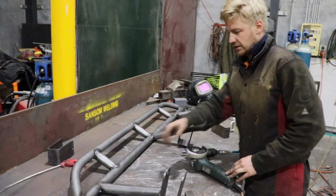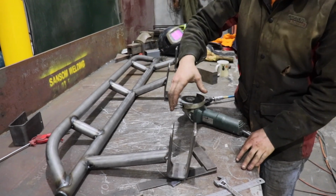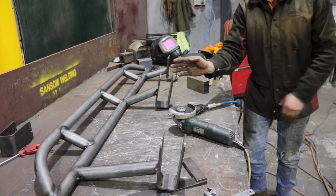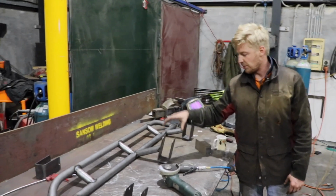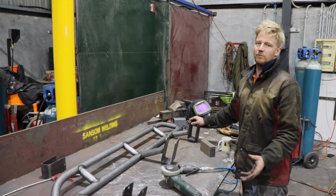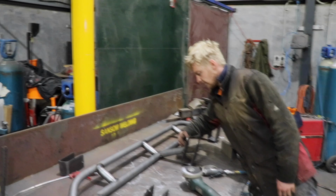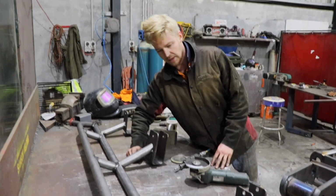You have a look here, the chassis on a 60 series, they come in and drop down and widen out a bit, and you've got this angle part here, and this is where your cross member is for the gearbox. The best place to mount these is just behind it, and a lot of places where you buy them, they'll give you two mounts because it's the easiest place to go. This middle mount has to be on an angle, so it makes this cut a little bit tricky when you're fabricating it, but it's nothing too bad.